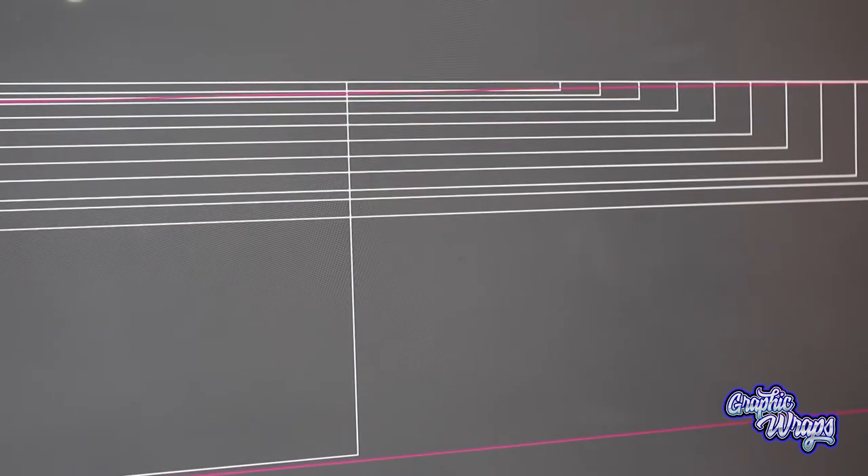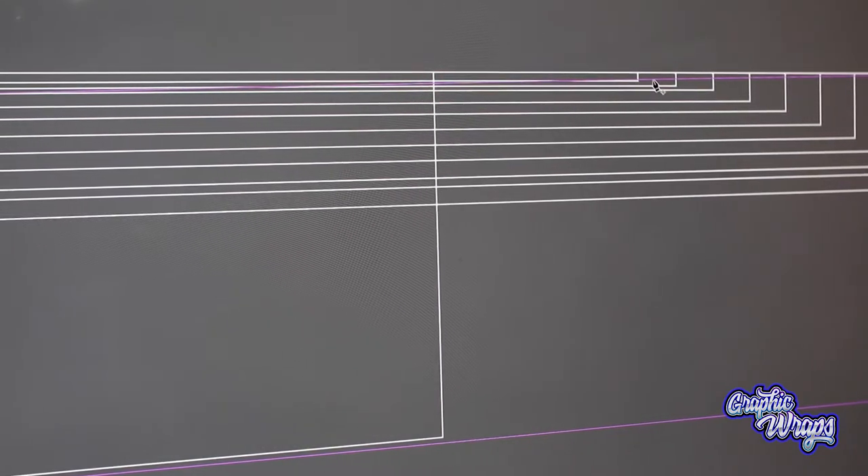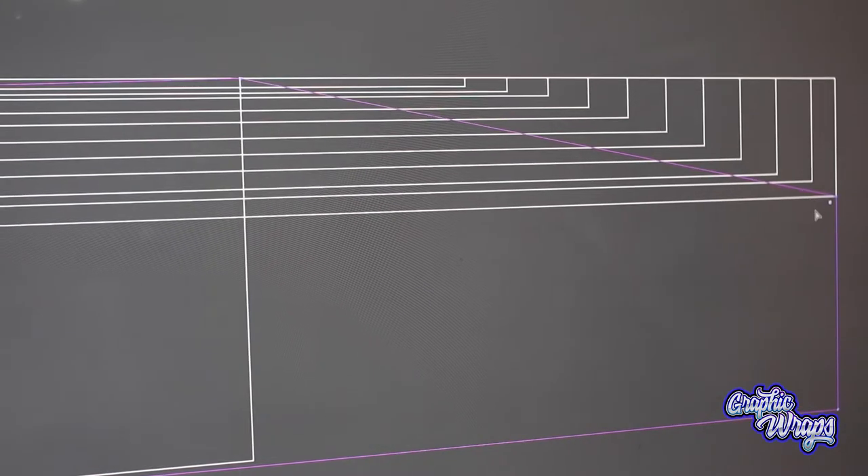Now, what do we do with all those plotted points? I add a node to the magenta profile line, place it on our zero point, then take the line down to the 6,070mm position — 70mm past the last measurement, where we recorded 300mm offset. I turn that segment into a curve and drag it until the magenta line hits all of those reference offset curves. The original bounding box is always there so we can refer back and check our work.